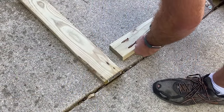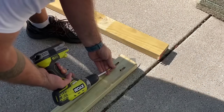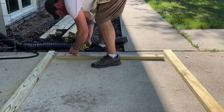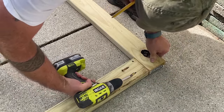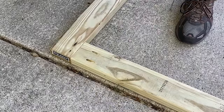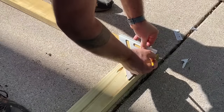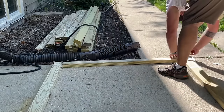Now that our 46.5-inch boards are all cut and the pocket holes are sunk into them, we're going to place those between the 8-foot boards and preset all of our screws. Once everything is pre-drilled, it's time to set all the boards — lining up the 46.5-inch boards in between the 8-foot boards. Once it's all assembled, we find center for the top and bottom boards: they're 2x4s so they're 3.5 inches, meaning center is 1.75 inches.